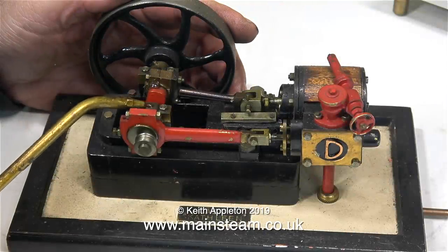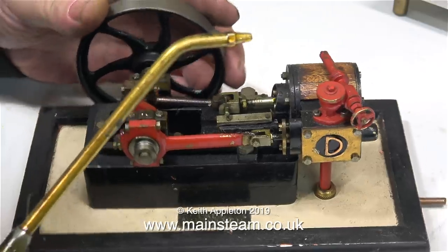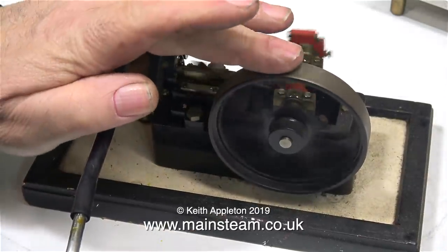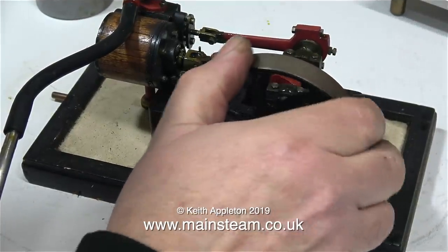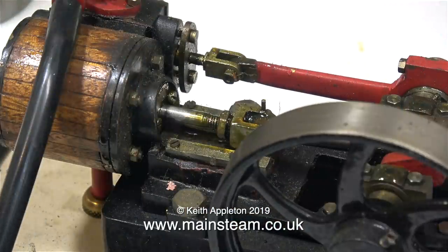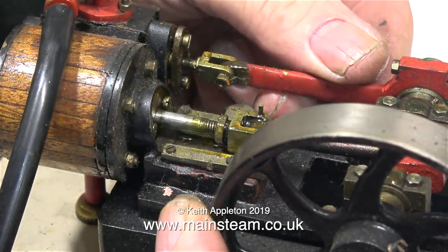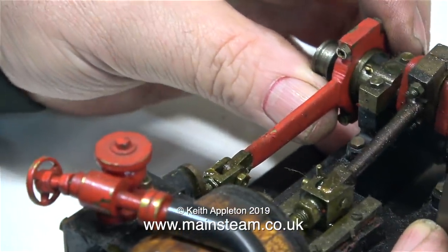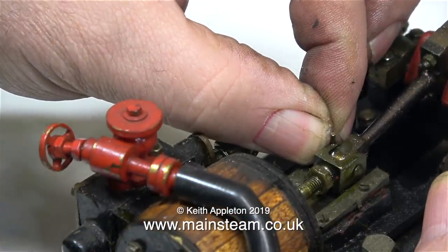Here's a good-looking little engine — maybe this will run. At first glance it looks to be quite well made. Good attention to detail and all the parts seem to be in order. Before I run any engine I always give them a bit of an oiling. This one runs. It photographs very well from every angle. It's a bit grubby and a bit old, but that's not a big problem. Everything looks okay. Although not visible in a single-frame static photograph, in a moving picture you can see the play in the eccentric rod — not a big problem, it wants fixing just to make the engine run a little more quietly. Without taking it apart I can't tell whether there's enough material on the eccentric rod to bush it or not. There's a lot of side play on the crankshaft — very common and really not much to worry about.